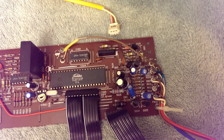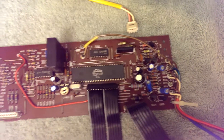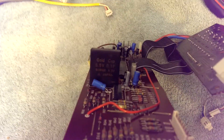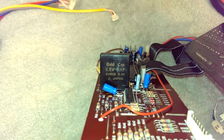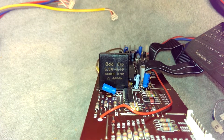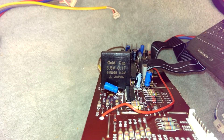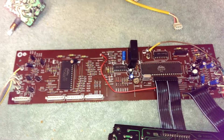Some various little capacitors and transistors to make things work. Speaking of capacitors, there's an interesting one here — a gold cap, 5.5 volts, one tenth of a farad, 100,000 microfarad. That's the memory backup capacitor. That's what keeps your presets alive when the power is off.